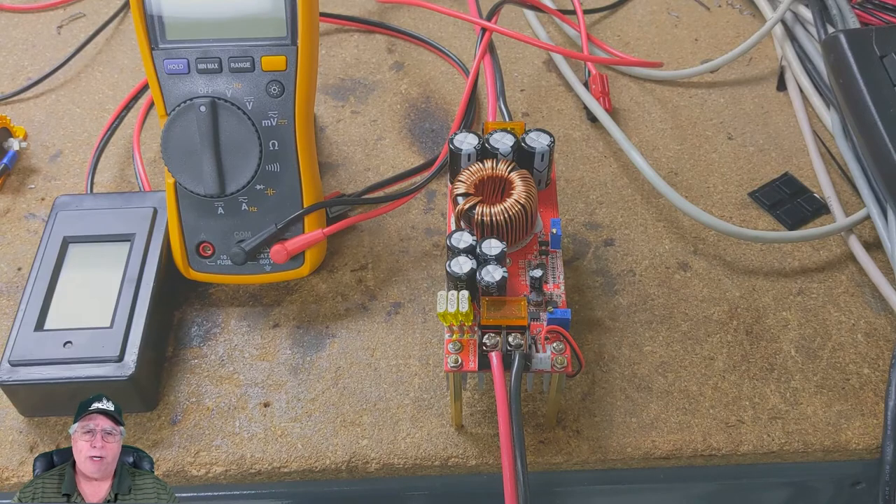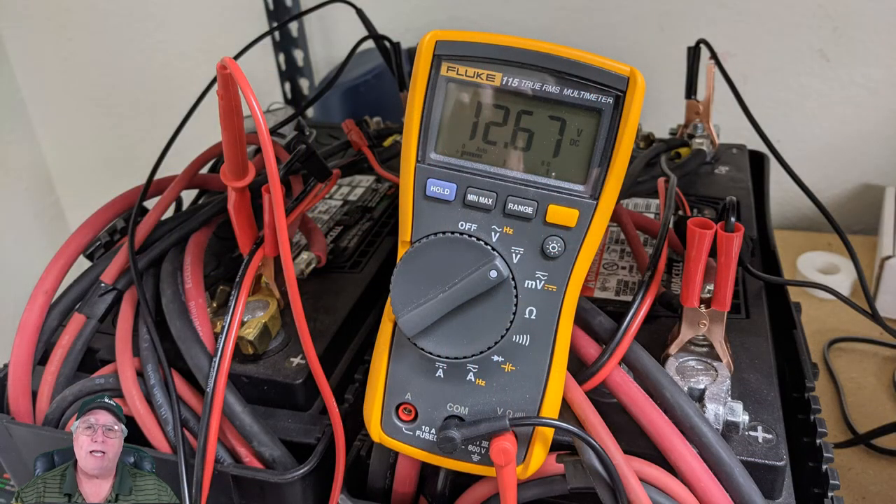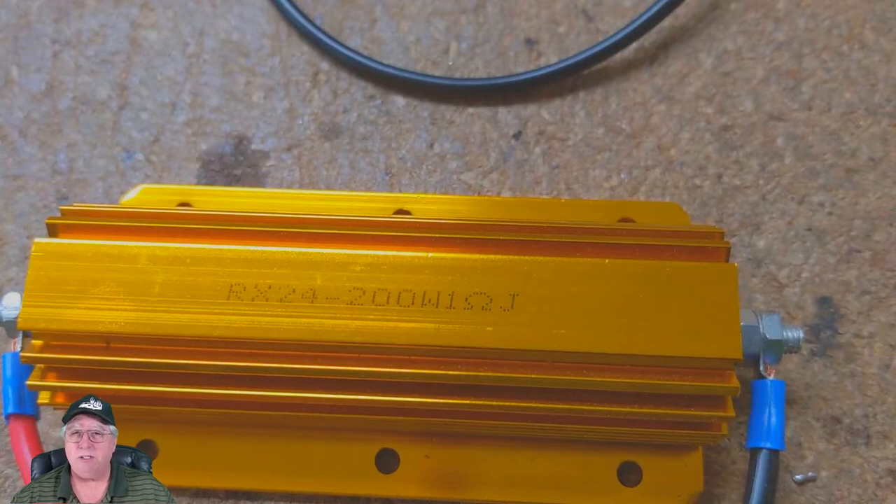So when I load this thing I'll have a general idea of what it's doing and how well it's holding the voltage I set it to. Now, if you look, the wire coming down toward us — that pair of wires — is 12-gauge zip line, and it terminates to a nice-sized battery. We've got a 100 amp-hour deep cycle lead acid battery. My Fluke is hooked to it right now and I'm looking at surface voltage. It has a full surface charge, so this will vary anywhere from 12.7 up to 12.8, and will probably come down to 12.2 or 12.3 under a 10-amp load over time.